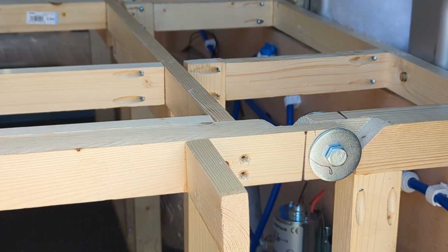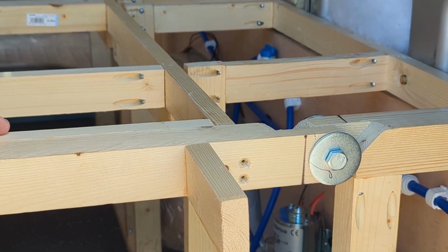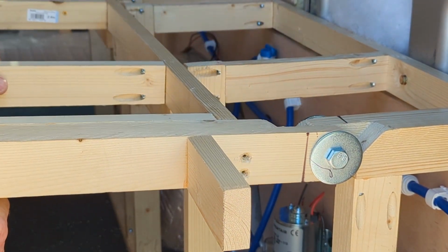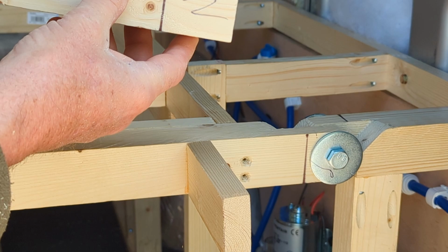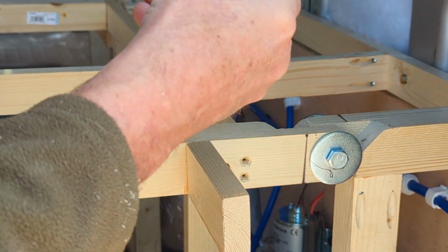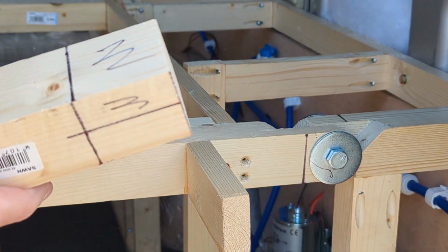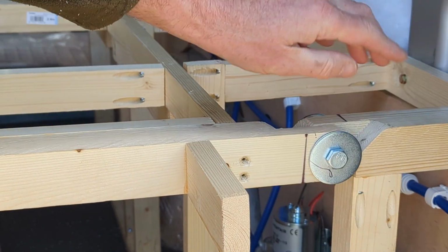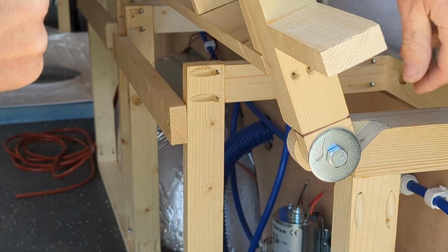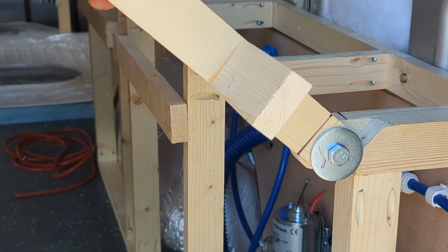So this hinge is one of the most tricky bits to do. Well, it's tricky for me, not having the knowledge or the tools. So that hinge there, I've got basically two pieces. I've got the piece that goes there, cut out that piece, and then a matching piece for that side, and the piece cuts out there as well, and then round them out a bit, and take a little nip off there, and the same on the bottom of the other one, just so they can sit in there a little bit easier.